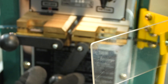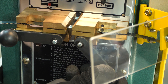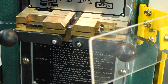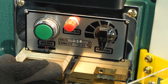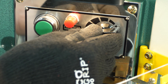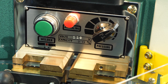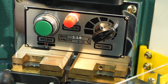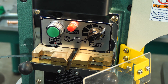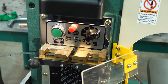You want the blade ends as close as possible. You can test fit here and see how square they are. You can see a nice square edge — it's pretty close. Now that everything is aligning in the clamps, go back to the pressure dial. For the largest blade you might go considerably further, but here I'm going about a third of the way. That pressure controls how much the blade ends are pushed together when welding.